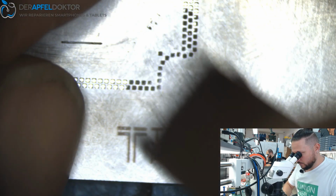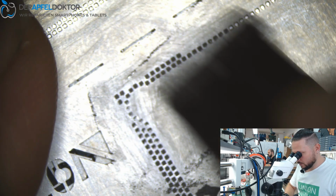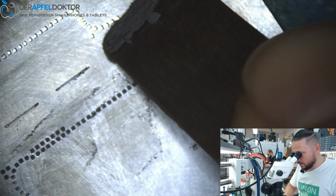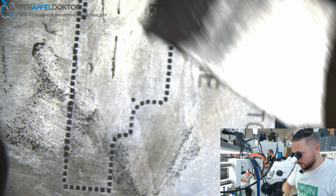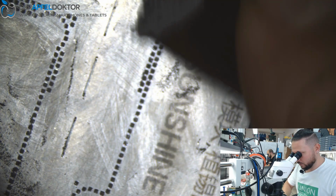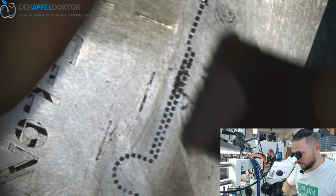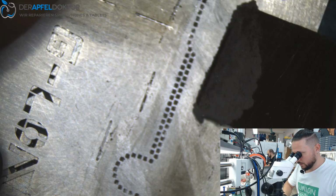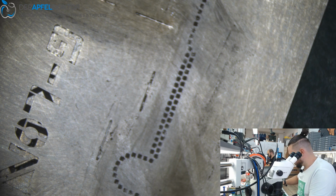And you see, we just have to put solder in here. So I'll explain one more time why I don't use low melt solder. It's easier to reball the board with low melt solder. Okay, you can do it with the help of a preheater. You don't get any stencil bend because you don't have to use as much hot air, but you get the same problem on the board as before, because of this low melt solder. It just doesn't get as hard as the 183.